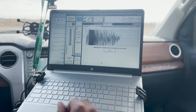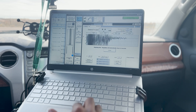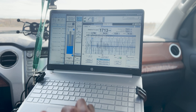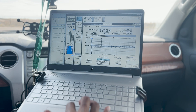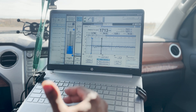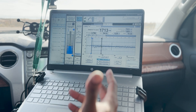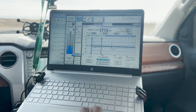We're going to let that trace run, and then put the shot complete and try to find this. That's a little bit more clear — a clear down kick right here at about 2.8 seconds, 1,700 feet from surface. So that means the echo, the reflection, should be twice as much. So if it's 2.8, double that is 5.6. This down kick right here should be the reflection of the fluid level — it should be around 5.6, 1,700 feet, 5.5. Close enough.